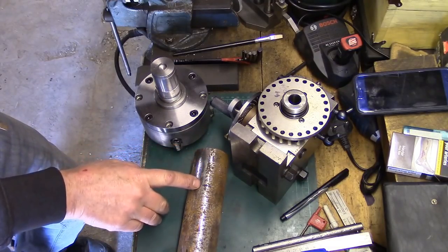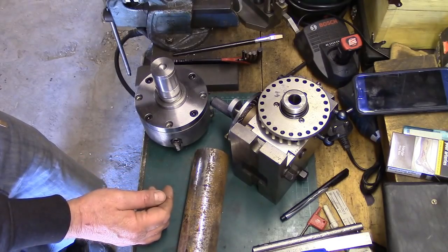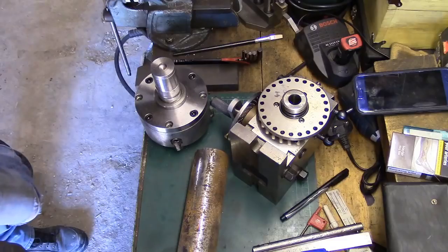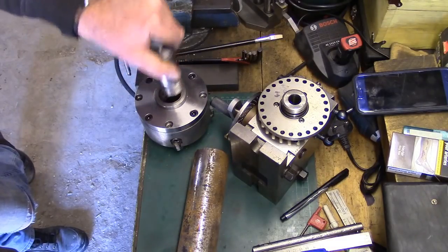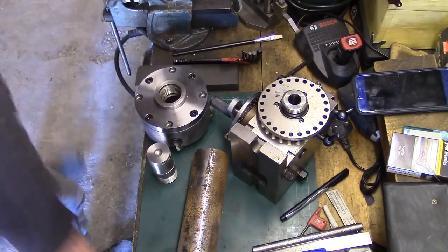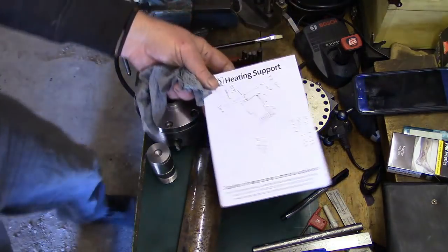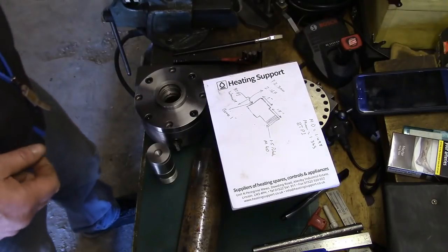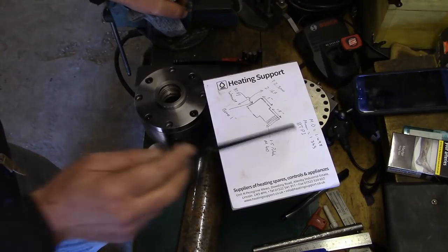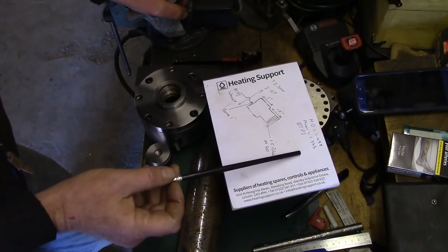I'm not going to really machine it to a particular diameter yet, because what we're going to do is bore the inside out, thread it, which is 6 TPI. Sorry, no, it's not. It's 8 threads per inch, this is. I think it's a UNC or whatever, but it's not actually listed on the Zeus charts or whatever. But I have had a little bit of a check there. So as far as I can see, the major diameter is 1.498, which matches up with this. The minor, or the internal of this, wants to be 1.343 for 8 threads per inch.